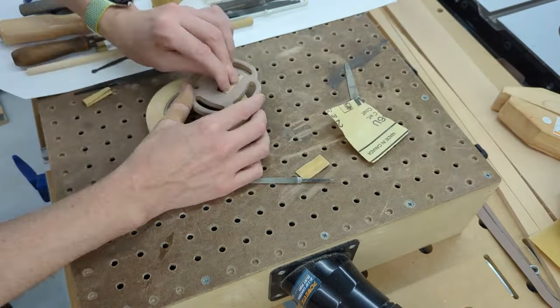When starting this project, I had no intention of making a corresponding saya or scabbard for the katana. But the more I thought about it, the more I realized that I had to. I begin the process at the planer, smoothing out one face of the board. Next, I use the table saw to cut the piece to length, and then the jointer to square up one edge.